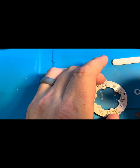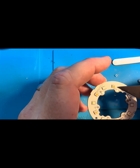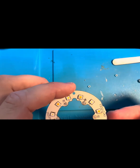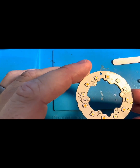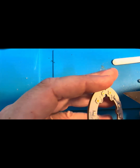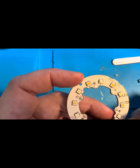Just push it off - quickest. But you want to make sure that your LED is secure to your MCPCB. Pushing them off - when we look at that, it's pretty clean. In the end, after this is all said and done, I'll go back through with a microscope and make sure to get all the crap off. You'll see weird angles on your ceramic around the edge of the LED, but that's really not a big deal. It's not what you need to worry about - you need to worry about the phosphor, the orange part.